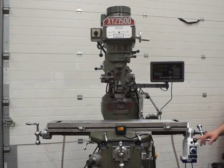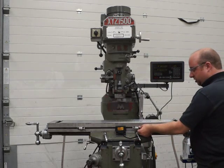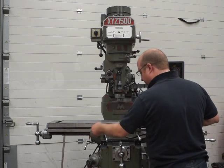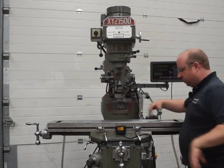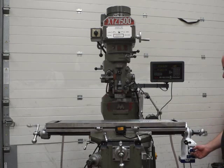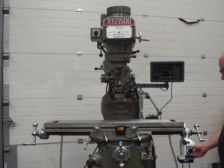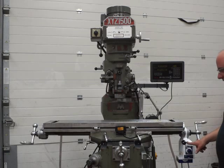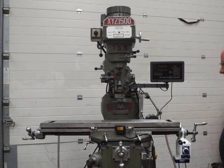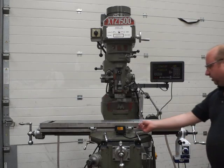With the power feed you've got these adjustable stops; you can put them anywhere you like — obviously you'd put them around your vice area so you're not traversing the whole table. You can vary the speed right down to almost nothing. I'll put it to rapid; take your finger off and it goes back to feed. When that stop touches the main switch it should just turn off.